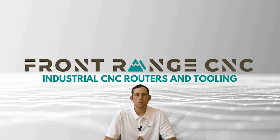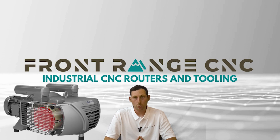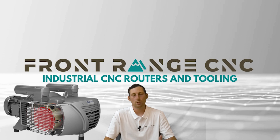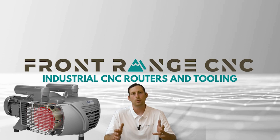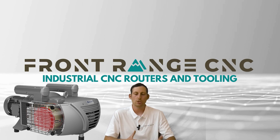For the rotary vane style, Becker is the most popular rotary vane pump you'll see in the United States. It's air cooled. The normal pump you'll see is the BTLF 2.25, which is roughly a 10 horsepower pump. That pump is good in terms of CFM and hold down for a four by eight table at 3,500 feet or lower altitude. You can still use that pump with a five by ten or even a five by twelve — it just starts to lose the ability to adequately hold the whole table with just a single pump.